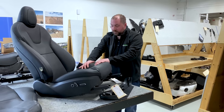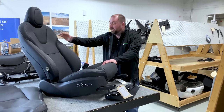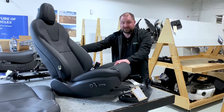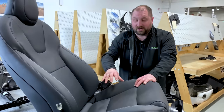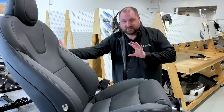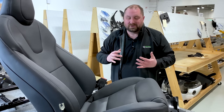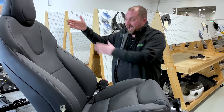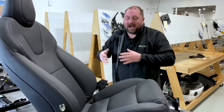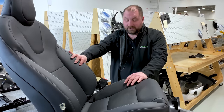We have a bunch of different components that are all working together. We have the structure supporting the seat. We have the foam supporting all of the bolsters in the shape. We have a back panel that is closing out a bunch of attachments. We have side shields that are covering up different mechanisms, the buckles. All of those things working together, completely surrounding this vehicle. It is a little bit of a different animal. If you compare it to a door panel, you're working from structure out. From an IP, you're working from structure out. I consider those one-sided components. A seat is not a one-sided component.